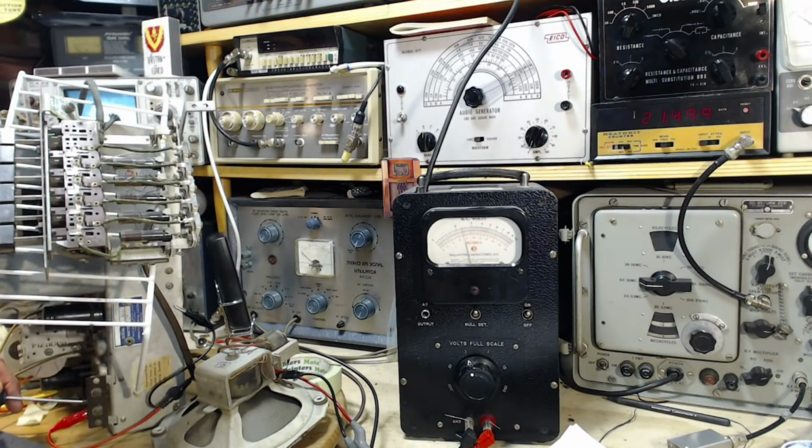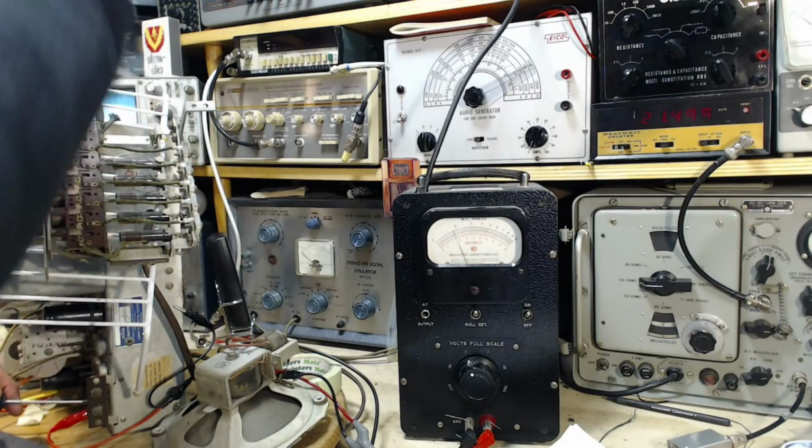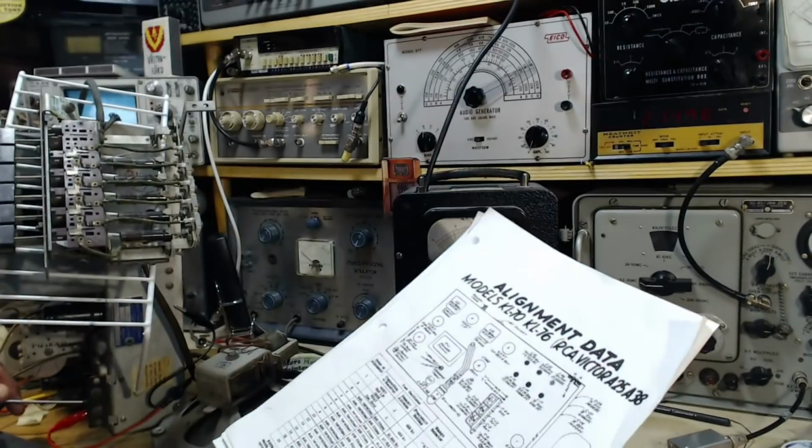So I think this suggests, is there more front-end alignment for this? The impression I get, right or wrong as usual, is pull this thing up, get the signal coming in, but the sensitivity's gone way down. The sensitivity up is really important, and the radio oscillator's way off. That's the quandary here. So yeah, you know what? There's an L involved in this too.